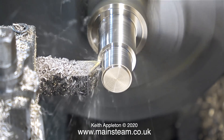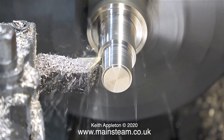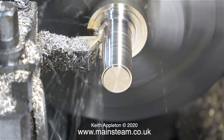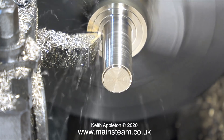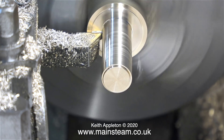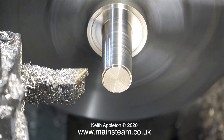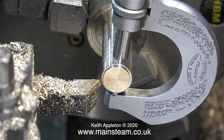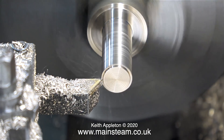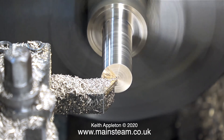It's not a good idea to use a piece of wood to deflect the chips because if you catch it in the work or in the chuck it's going to fly across the workshop. The video is running in real time and I'm nearly at the end of the job. There are now many chips of phosphor bronze all over the lathe bed, on the lathe saddle and on me, and the problem is they're all very sharp. A final test using the micrometer shows the finish size is half an inch. Apart from the very end bit which was a test cut and was too small, I'm now machining that away.